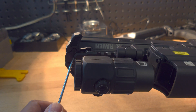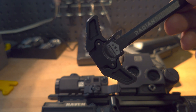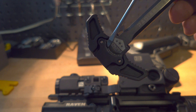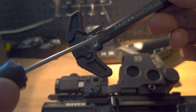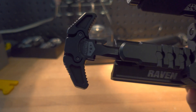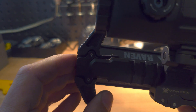We're going to have to file down this part of the charging handle. I'll take it out and demonstrate. With a file, a drill, or a Dremel, you'll be pushing back the material on the charging handle until it interfaces correctly with the upper receiver and the charging handle latches. This is the part of the upper receiver that we're trying to get the charging handle to interface with. Once we have enough material taken off, it will then latch.